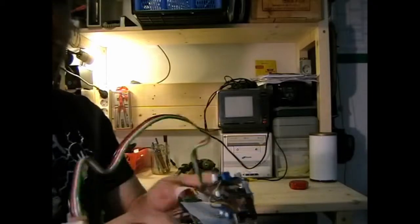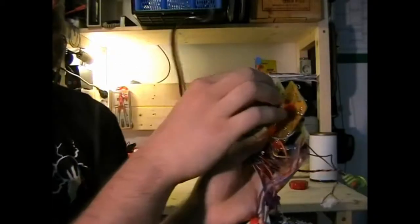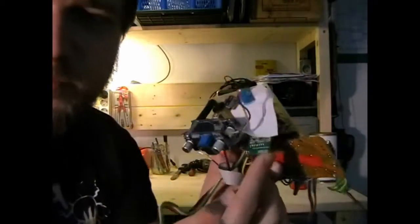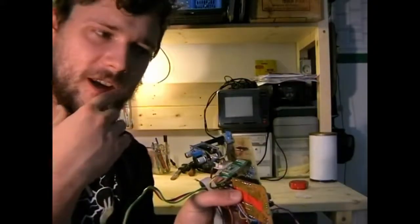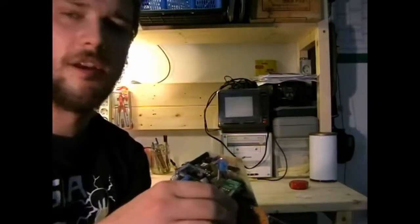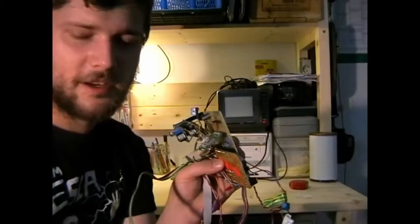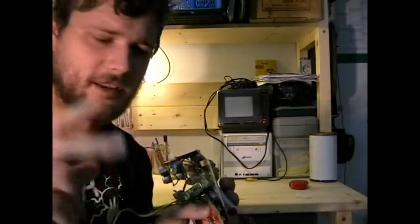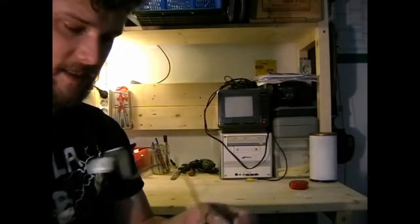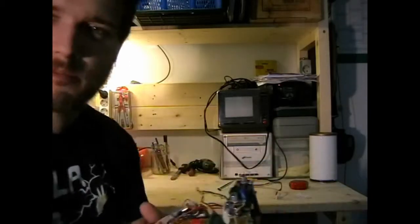Okay, let's start with this here. So we got this Arduino, which talks to an RFM breakout board via SPI. This is just a radio module that will do 70 centimeters, and with a little hack you can bring it to transmit with radio teletype. Normally it uses FSK or some modulation to transfer data bits, but with radio teletype you basically just set it to a frequency and change the frequency, and this will give the information. So it's a very simple protocol and provides a very simple data transmission. Can be decoded with practically a wet rag.